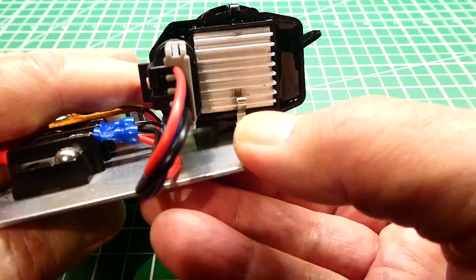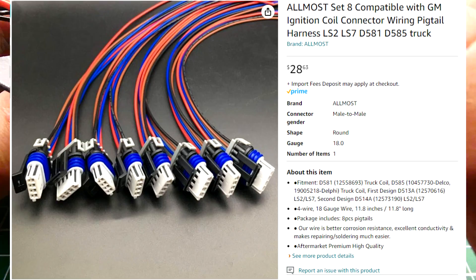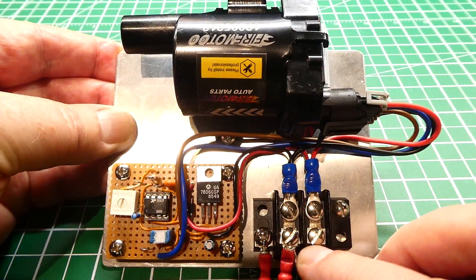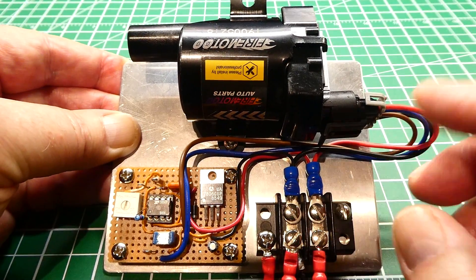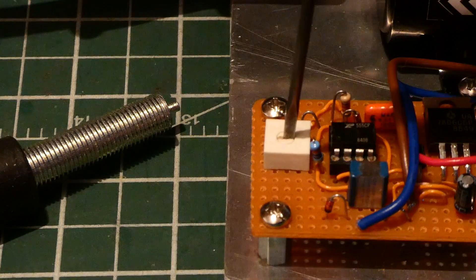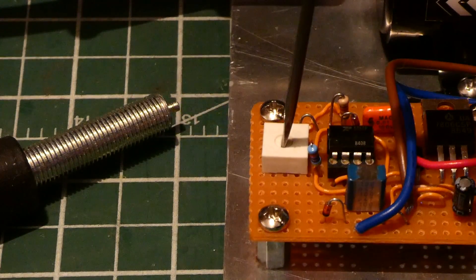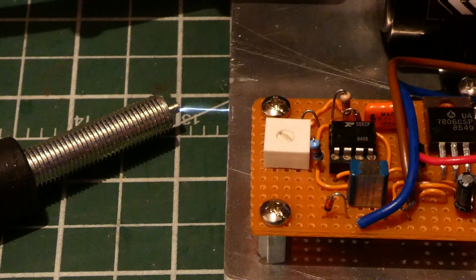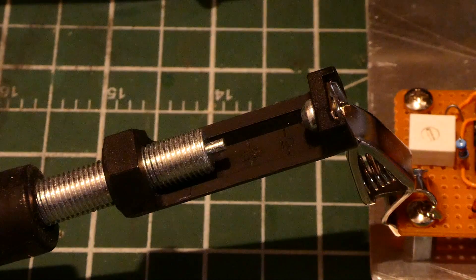You can see on the back this is where the electronics is, with the heat sink for the IGBT, and this is the connector which has the clip on the top — you can get these online. Next we're going to power this device up with 12 volts. It needs about 10 amps, so we use a battery or power supply. I've got my spark gap tester hooked up to the coil, set for 14 millimeters, so we'll give that a try.